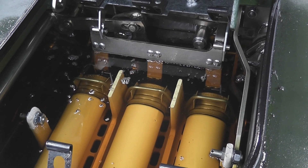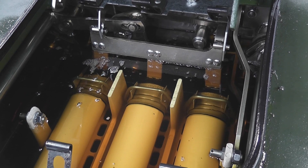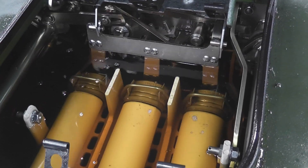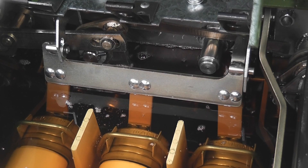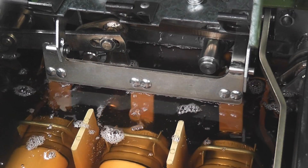You need a bit more voltage to operate it. I'm going to reset the device and we'll do that on the other phases at the same time. Reset. Close the switch again. Swap it to the other phase. I've had to cut the other striker pin off to make it operational. We'll watch again - see how quick this goes. Instantly de-energizes the device.